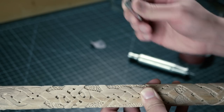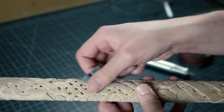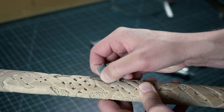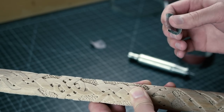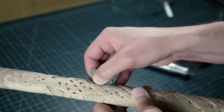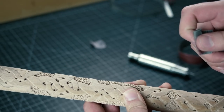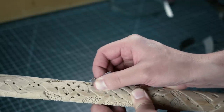After that, I'm going to take a piece of sandpaper — and here's the trick: you need to go up in your grits. I'm going to use around a 120 grit right here. I'm not just going to go over it like this — you see this little crevice? I'm going to get the edge right in there and just sand it. My grain is running this way so I'm sanding across the grain, which isn't ideal, but you've got to do what you've got to do. I go up and down, cross-hatching my sanding marks, and that actually makes it smooth.